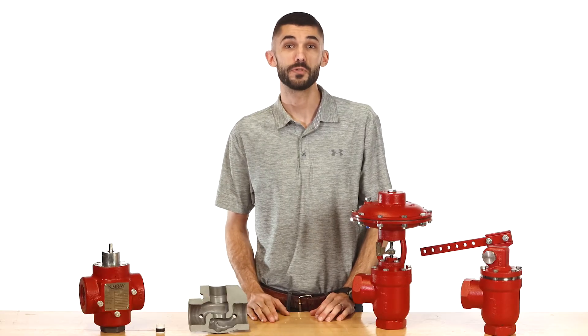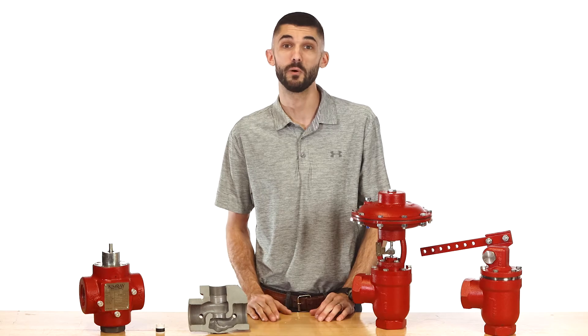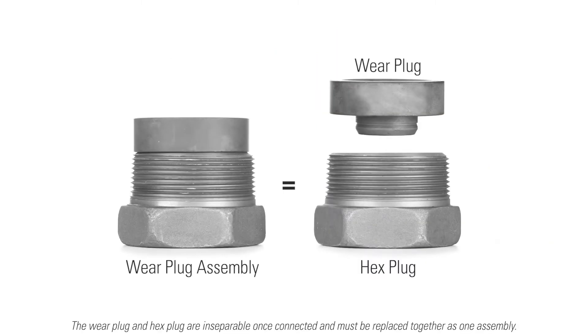In this video, we'll show you three dump valves that help you limit the sand's impact so you can maximize your well production. The T-Body high pressure control valve is designed specifically for erosive production conditions in today's oil field. The key feature of the T-Body is a hardened, replaceable wear plug.